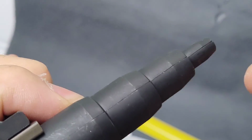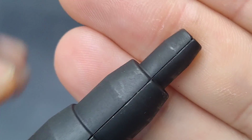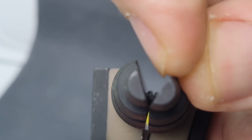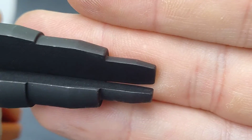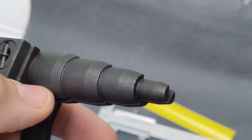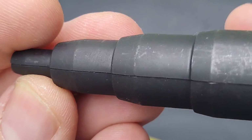With this, you can always ensure that your expansion is correct all across the diameter of the tool, without the risk of a crack developing here. So basically what you need is to constantly rotate it through the process, and this is how you make sure you don't have cracks and you are expanding it correctly, on all sides of the circumference of the pipe itself. As you see, it works with various different dimensions.